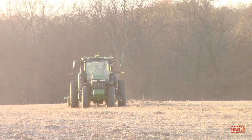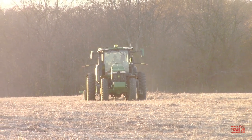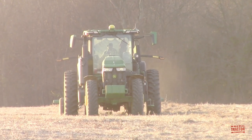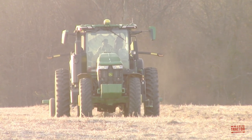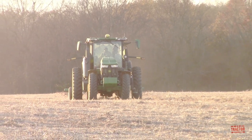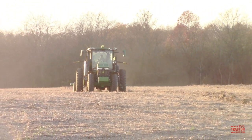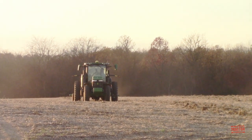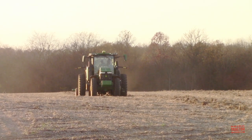John Deere announced the latest generation of 7R series tractors in late October 2019, and the series went into full production in June of 2020. Starting with model year 2021, the 7R series will include tractors from 210 to 350 engine horsepower. The John Deere 7R210 is the entry-level model in the series. It's powered by a John Deere 6.8-liter turbocharged 415 cubic inch diesel engine, rated at 210 engine horsepower, 231 maximum horsepower for when the tractor encounters tough field conditions, and 170 PTO horsepower.